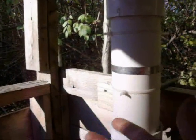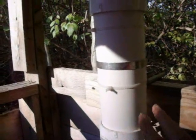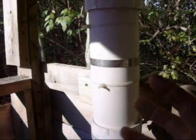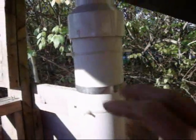From there, the gases come out and they come into this filter. I have some open-cell foam — it's like that yellow foamy stuff they put in cushions for couches, campers, and stuff like that. It's got a bunch of holes in it. The gas is sucked through here and it takes all the dust and fine particles out, and traps them in here so they don't get put into the engine.